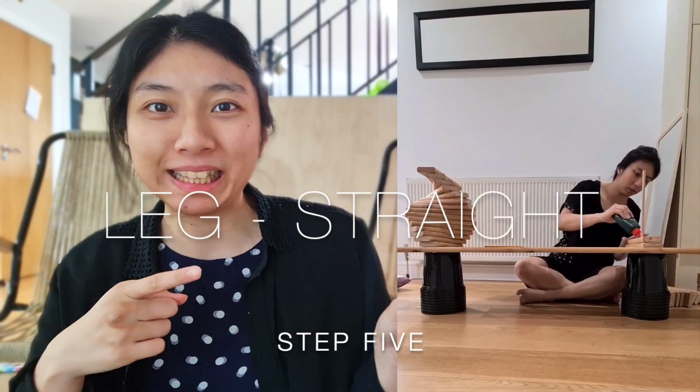So here I'm stacking the other leg, which is the straight one. It is exactly the same process as before, only this time I didn't do a dry run, went straight into gluing. The only thing I want to point out is I used 2 pieces of wood and just sandwiched them as they went to make sure they were leveled.